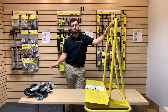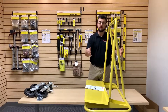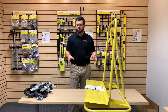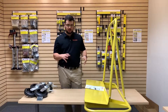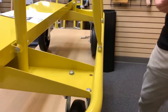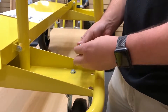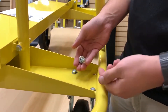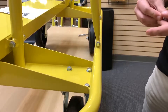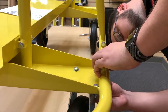You have two locking and two swivel casters. Mount the two locking ones on the same short side and the two swivel ones on the other short side — that gives you the versatility of a fully moving cart or one that swivels about two wheels. Essentially, you have a rectangle bolt pattern: drop the stud through from the top, use the lock washer and flat washer on the nut side, get everything finger tight, then come back with a wrench and tighten everything up permanently. By the time you see this cart next, it'll be all finished and ready to roll.